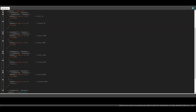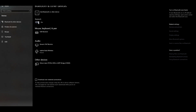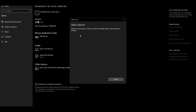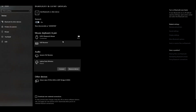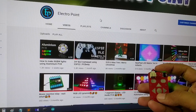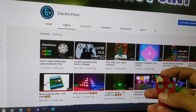This is the code for the project. Here I have used the BLE mouse library to control mouse movements over Bluetooth. After uploading the code, open Bluetooth settings and click on add new device. From there, select ESP32 Bluetooth Mouse and it will be connected to the module. Now our hardware is ready — for example, I have made this wireless mouse emulator to make mouse movements using the touch pads.